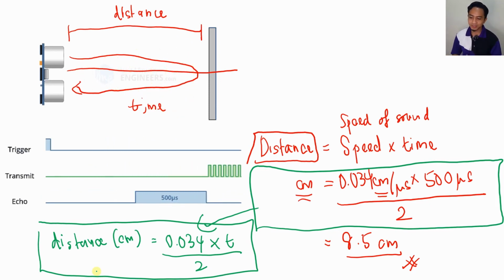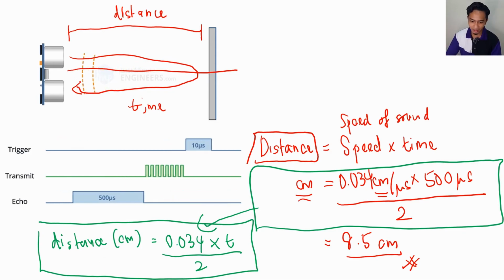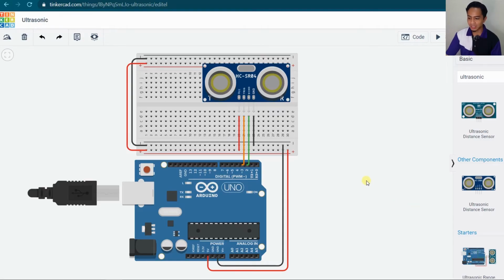And as usual, before we end our video here, I show you again the circuit, so that you can construct it before you proceed to the next video. This is how the circuit will look like. Ground goes to the ground, VCC goes to the power supply, and trigger and echo will go to the digital ports, and that's it.